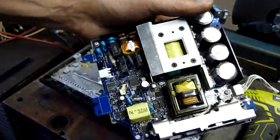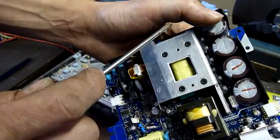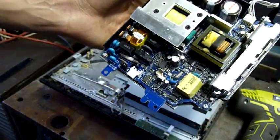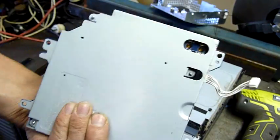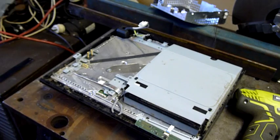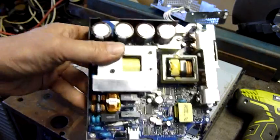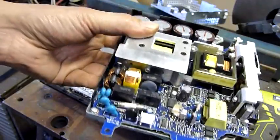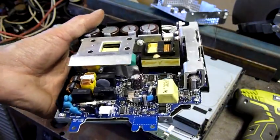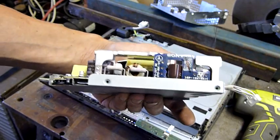Got a nice chunky little power supply. We've got primary and secondary side, nice big DC filter caps, various switching transistors and diodes, and a nice big bridge rectifier under there. Heavy little unit — 32 amps DC. I'll be keeping this one; I believe it still works. The unit itself is throwing up the orange light of death, which is probably a mainboard solder joint failure on the main BGA chip. But the power supply should be okay — I'll hot-wire it and use it as an electrolysis power supply. But yeah, that's the PlayStation 3 switch mode power supply — first generation anyway; second and third gen are probably different.